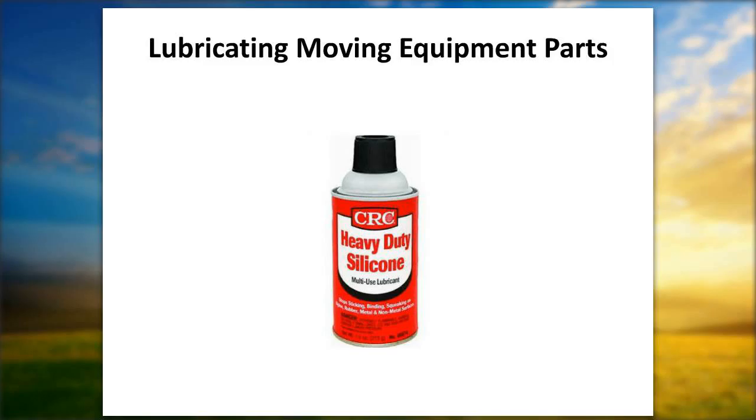You have a lot of linkages and stuff underneath there that if you spray a good coat of this silicone on before winter, basically the snow will not adhere to the mechanical points of the collector itself and be able to move just a little bit more freely. So give it a good spray on the underneath. And also, when you've removed the buckets from the two bucket collector, feel free to spray the linkages on the arms to where they can move back and forth.